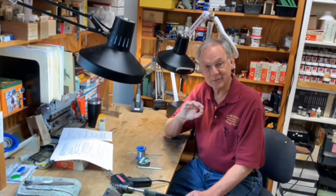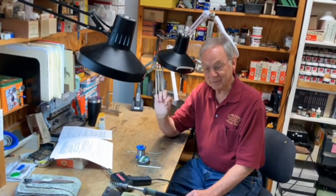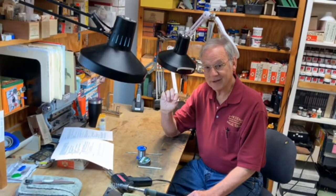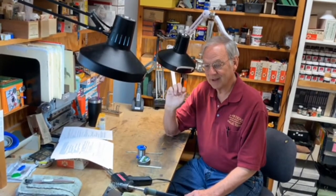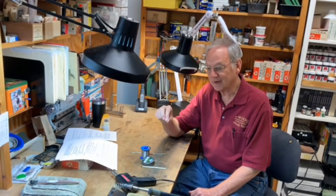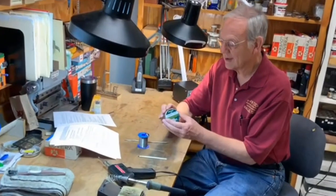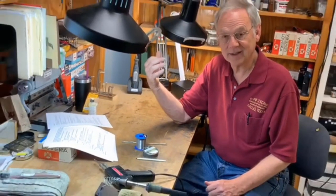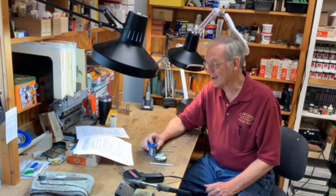The metal has to be clean. Metals form a superficial oxide layer. The mixture of solder and metal does not occur well if there is an oxide, and it's not good enough just to polish the brass with a wire brush or sandpaper, because oxidation occurs rapidly and even more rapidly when you heat the work to apply the solder. So we use a flux — a flux is a compound. This is rosin flux; this is acid flux. The flux is a reducing agent and it eliminates the oxide at the surface of the metal long enough for the soldering to take place.